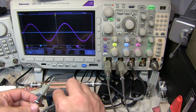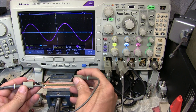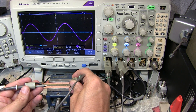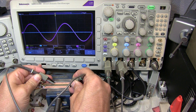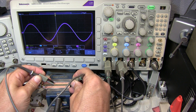I've got the AFG producing a 100 hertz sine wave, visible on channel 3. If I take these two probes, which are not properly compensated, and probe the line — channel 1 shows a waveform basically identical to channel 3, and channel 2 is also right there as well. So at 100 hertz, everything is fine. The fact that these probes are not properly compensated doesn't really matter so much at this frequency.